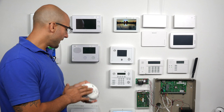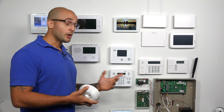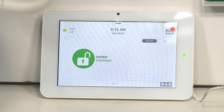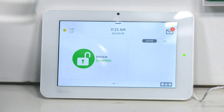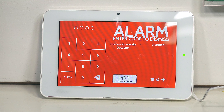So as we already have this programmed and our IQ2 is not monitored by a central station, we are ready to test the device. It's very easy to do. There is a small hole right here in the middle of the CO detector. I'm going to take a screwdriver, put it in the hole, and press the button. As you can see, we did get an alarm and it is giving us the carbon alarm sound. I'm going to go ahead and disarm it.